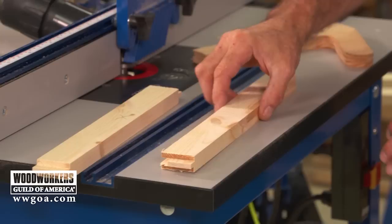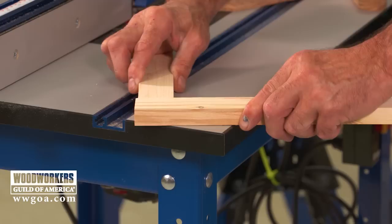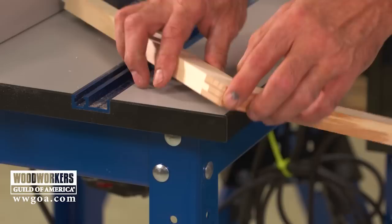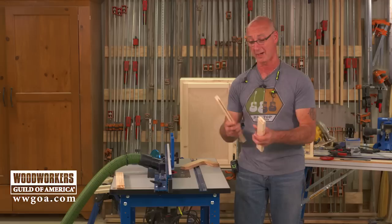Our test is to take the piece fed face down, then flip and bring them together — are they flush across the face? I have just a little bit of a high spot there, not a gap. So I'm going to make an adjustment in my cutter and then come back and groove all of these pieces when it's right.